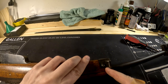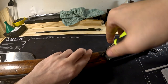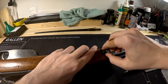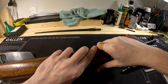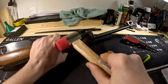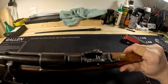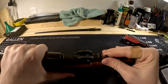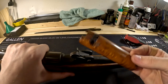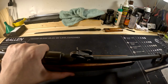Make sure you use the appropriate sized flathead bits for this because these screws are old and you will strip them. Get one that fits just right and then unscrew it. Take that screw out — this is where your rubber mallet comes in handy, just tap it a few times and it comes right off. Move down a little further to the front sight, flip the front part all the way back, then remove the upper hand guard. It's just a flimsy little piece of wood but it works — put that to the side.